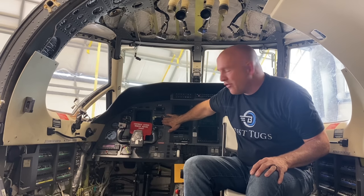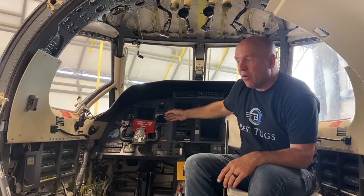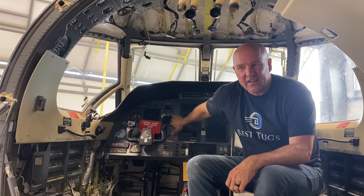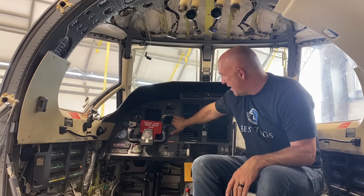Our altimeter, we noticed the last few flights, always was a little bit off. When we landed, we'd look at FlightAware, and if we were flying at 28,000 feet, on FlightAware, it showed 28,100. If we were at 24,000 feet, FlightAware showed us at 24,100, and I talked to ATC on a flight and said, hey, I'm at 28,000 level. What do you show? And they're like, oh, you're showing 28 and bouncing, or you're showing 100 foot high and sometimes bouncing to normal. So that's gone. That's going to get fixed. I want it to be accurate, like really accurate.